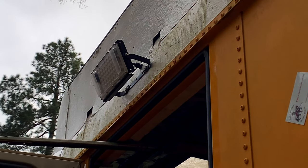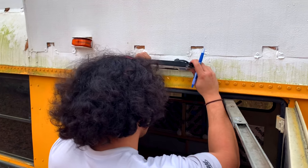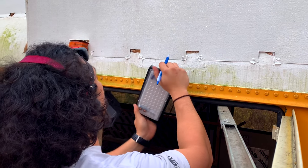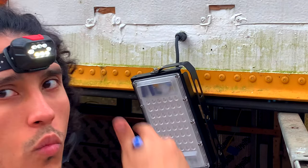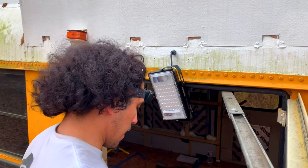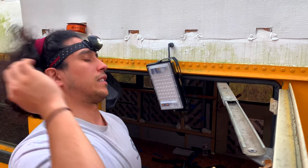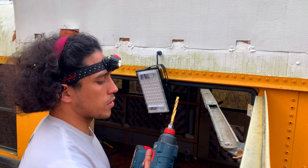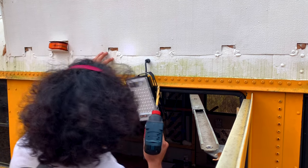The first thing I did was place it on here to see where I need to drill the holes, and with a pen I just marked those holes. Then I drilled a small pilot hole with a 1/8-inch bit just so I know where to go and the bit wouldn't walk with the bigger bit. I'm supposed to be drilling a 5/16-inch hole but I don't have a 5/16 drill bit because they all broke when we made the storage boxes, so I'm going to use a 3/8, which is one size up — it should be perfect for the application.